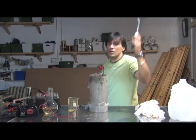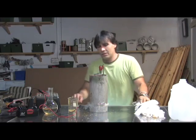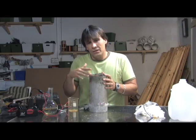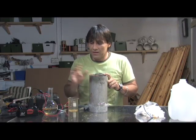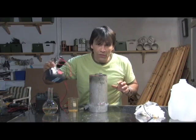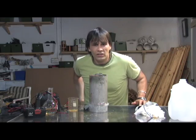Now we're going to see — this should be loud. In the comments section below I'd like you to write in your opinion on whether you think a hydrogen generator can actually produce more combustible energy for your car than it drains off your alternator. Keep in mind that with the final amount of salt we put in we were pulling 10 amps — 10 amps at 12 volts is 120 watts, and 10 amps at 20 volts is almost 200 watts. You really wouldn't want to go over 10 amps because the wiring really starts to get hot.